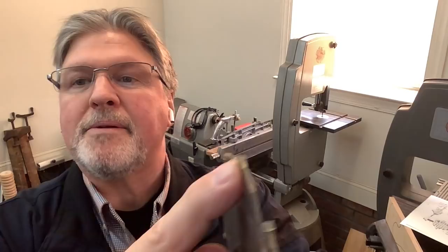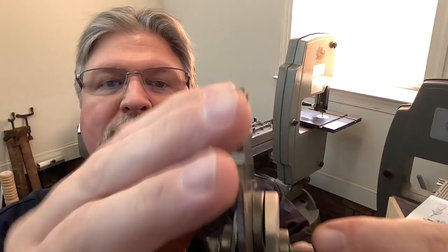And they took the tooth that would then be the furthest off to the side, and they ground that, if you can see it, at a bevel. And then if we find the opposite tooth over here, that one's ground in the opposite direction, so that this blade at its greatest opening, maybe 3/4 of an inch, is getting us relatively close to a flat bottom. The problem is, on the smaller dimensions, now you have a couple teeth that are basically like an alternating bevel. So even though some of these are flat, some of these are angled, and we don't get a perfectly flat bottom.